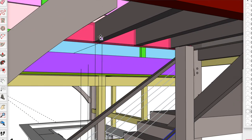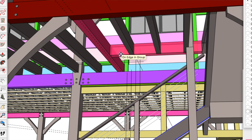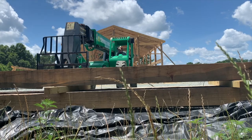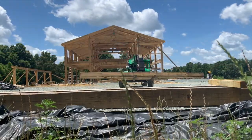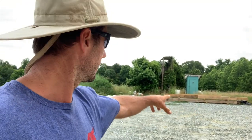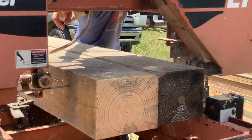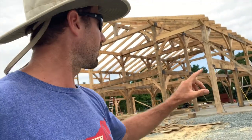We figure we're going to run two joists past this post right here and end up with a six by ten, which we have to resaw on our sawmill out of a scrap ten by ten. One of our strategies on this project was to order a few extra key pieces of heavy timbers that we could resaw into other material. For instance, we'd always order an extra longer piece so we could use it for a shorter piece if it was twisted. We're going to mill a lot of these ten by tens into six by tens and other material we need for siding backing — nothing goes to waste.